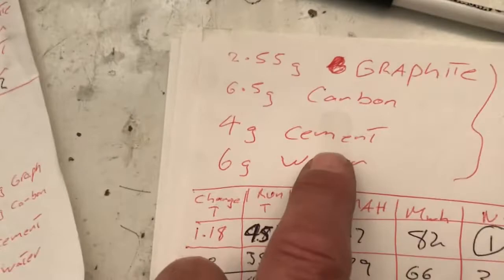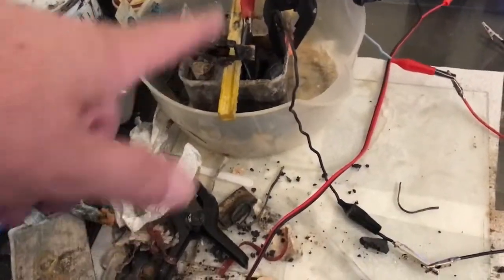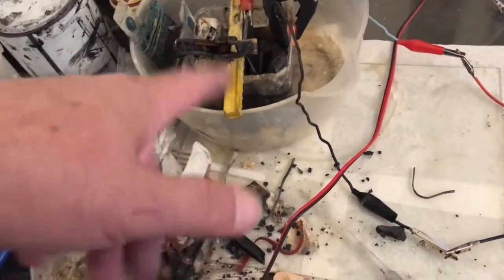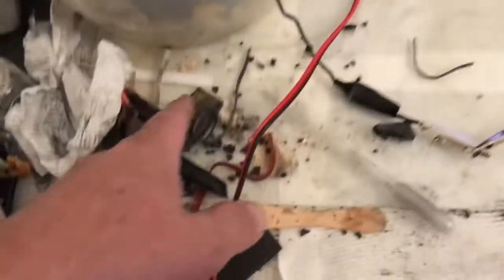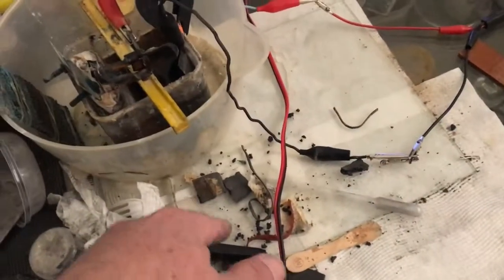To update: normal Portland cement holds up in potassium hydroxide electrolyte. I've had one of them in there for six weeks and it didn't fall apart. This one is as hard as a rock - took a bit to break that one. That particular one wasn't very good as it had a higher cement content.